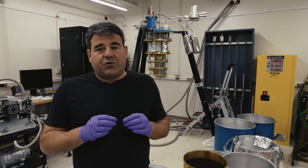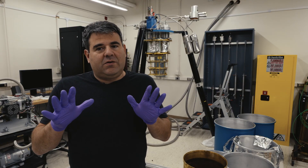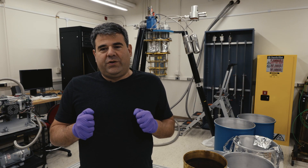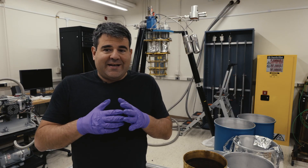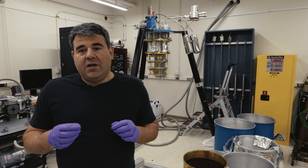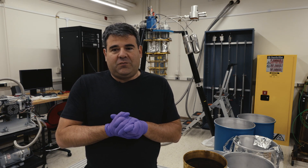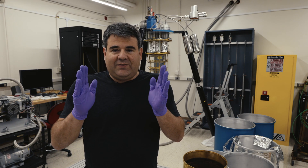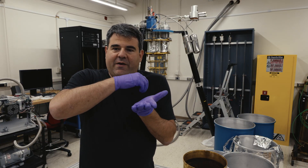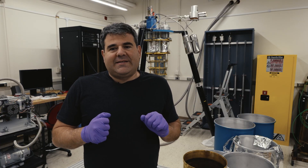Maybell has picked a slightly different trace width pitch and they're only using eight coaxes per cable. Whereas the experiment we need to upgrade, MEC Prime, needs 10 coaxes in the cable. So what we've got to do is make our own. We've done this before — basically we take two pieces of niobium titanium foil, crimp them, lay a wire in it, and spot weld all along the length.